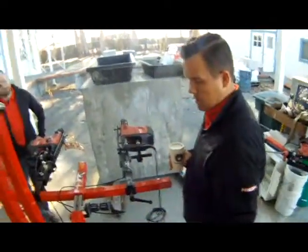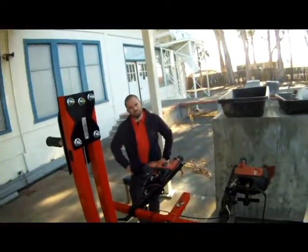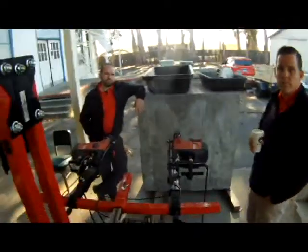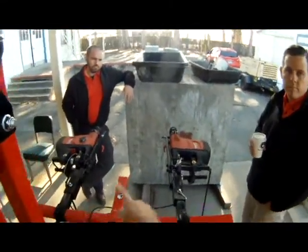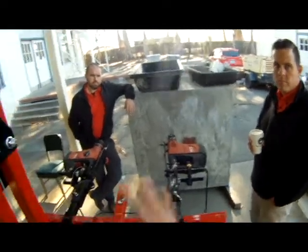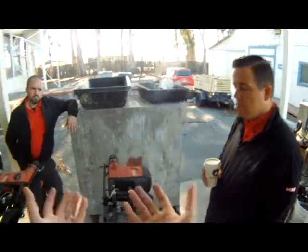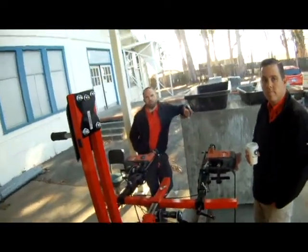Look, we've tried all kinds of magnetic torpedoes and whatever. First thing you have to remember is you're doing the work that a guy would be doing by hand. And that's the tolerance we work with. You go in and drill those holes by hand, I'll drill exactly the same hole with this. So we're not looking for 0 degrees held true. At full extension, there's some flex in this. It might be a degree, depending on how much weight we have out here. If we have a TE-70 out by itself, probably negligible. But if we have pneumatic wheels on there, they compress as these go out, so you might get some dip. There's always some squishiness in this; there's going to be more with the human anyway.